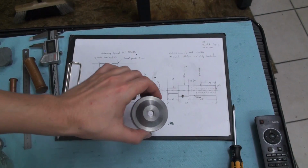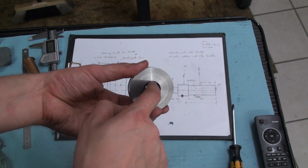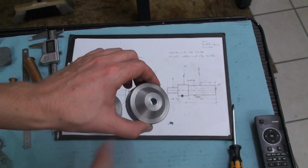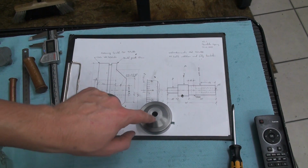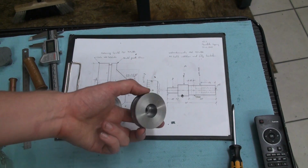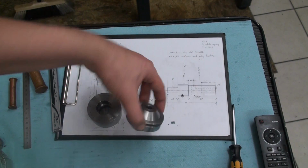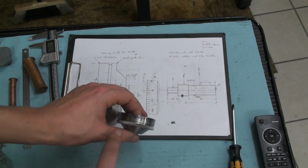Okay, I pressed the drill bushing in from this side, you can see it, and I faced the end off. The drill bushings are only case hardened. Once you're through the outer case hardened layer, they machine pretty good. Yeah, that's the finished dial without the engraving.